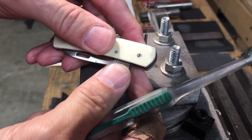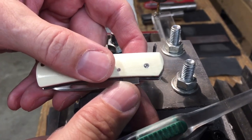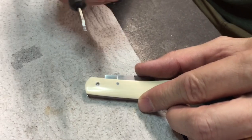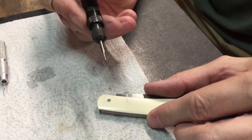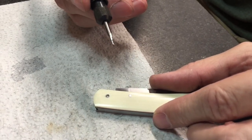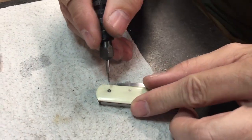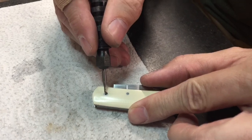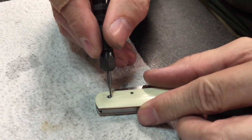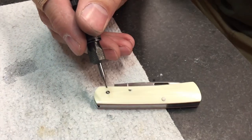It may have done it a little bit — I may have enough out for what I need to do next. What I've got here on my Dremel flex shaft is a 3/64 carbide ball-end four-fluted end mill, and I'm just going to go in here and try to open this up a little bit. Using that 1/16th-inch hole gives me somewhere to start and try to open this up around here to get the head off that pin.